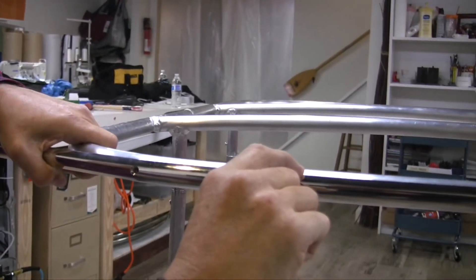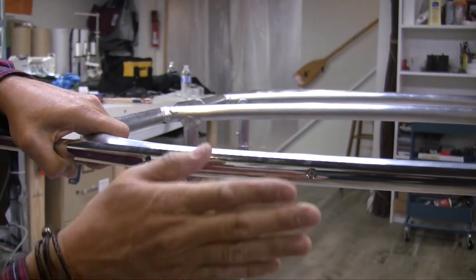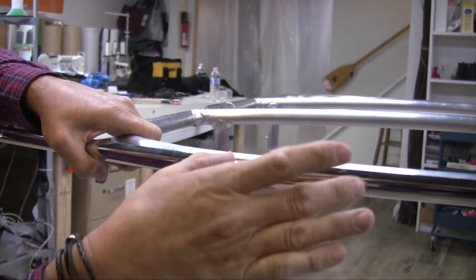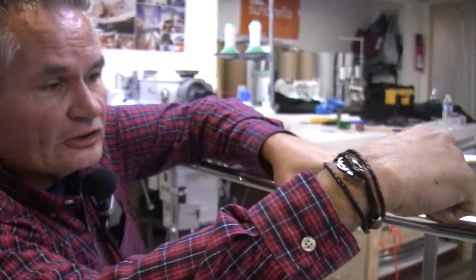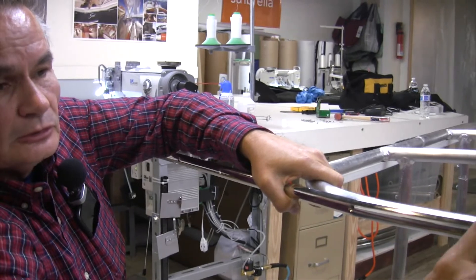Location of the band — normally I do it on the face like this. I've seen some larger structures where you're actually bringing the fabric around and putting the band on the inside. It holds a little bit better because you've got the tension of the fabric pulling on the pipe and then the band holding it there — so you actually get more holding power. I've also seen some where they put it right across the top. This way you can still see the nice aluminum or stainless rail.